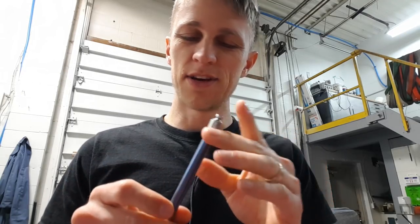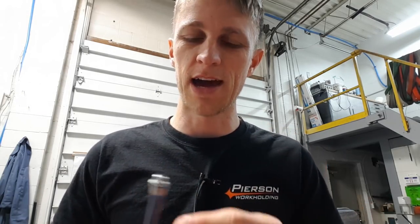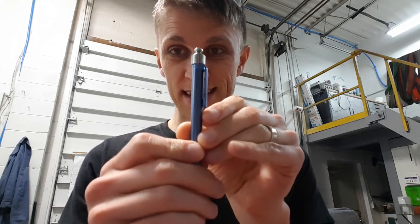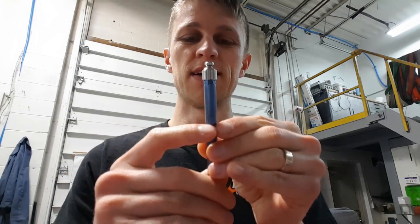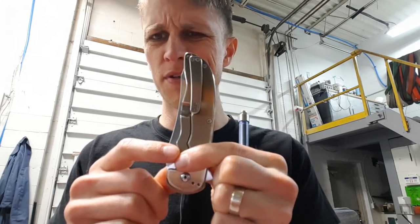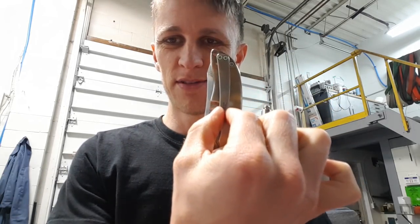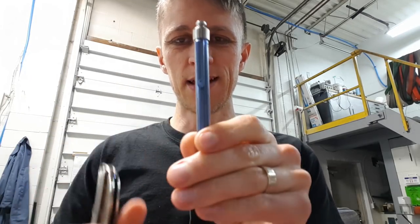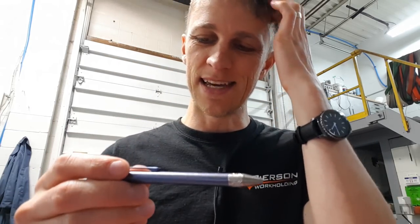This design encompasses everything I like. The clip is always super important — that's why I'm spending so much time getting it right. It's sleek, and it tapers down one degree because a square clip just didn't look right. This ancient Norseman number one from 2012 — notice how the clip tapers down ever so slightly, probably more like four degrees — but the pen clip is one degree taper. I love it. Everything gets thought about, everything gets touched, everything gets detailed. That's what I love to do.